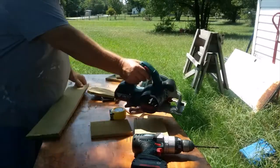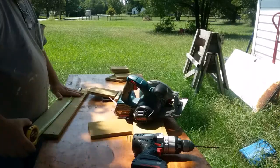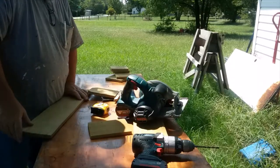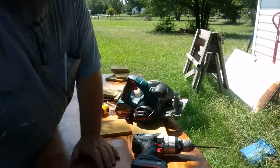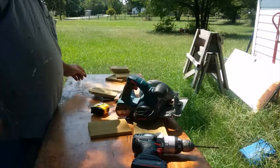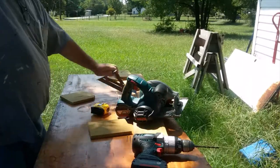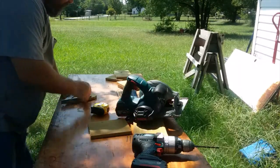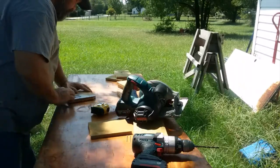Look what we have left over — that's probably still 26 inches left over right there. So you can get several of these from just one board. I generally buy about a dozen at a time because I'll make other things out of them too. So we've got our piece for the roof. Now we've got to cut our ends, and like I said, I put a 45 degree on the front and back walls.